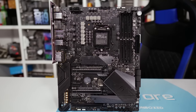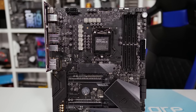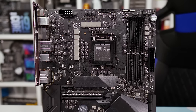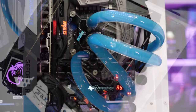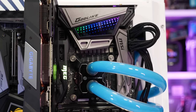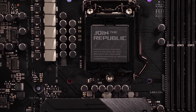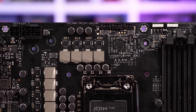What have we learnt? Beyond a shadow of a doubt, the ASUS ROG Maximus 11 Hero is a four-phase motherboard — a fat four-phase motherboard. It works well enough, but is without question inferior to all competing boards of a similar price. I suspect a number of boards that are even cheaper will be better, namely those from Gigabyte. Getting the Maximus 11 Hero stable at 5.1GHz with my sample was seriously difficult and actually required more voltage than the other boards I've tested. The use of a four-phase VRM means poorer voltage regulation, more ripple, and hotter operating components compared to what we've seen on the 10 and 12-phase boards tested here.